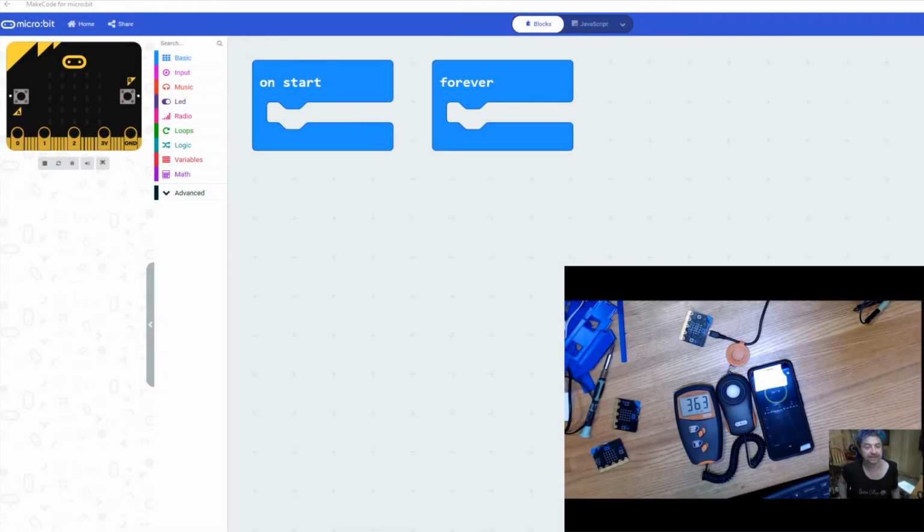Alright, so in this activity what we're going to learn is how to calibrate the light reading from a microbit into a lux value. Why that matters is plants care much more about light intensity, because if the light isn't intense enough, the plant isn't going to have enough energy to undertake photosynthesis. So you're going to need one other piece of equipment to be able to do this.